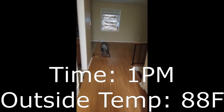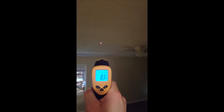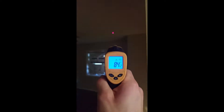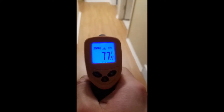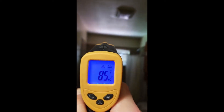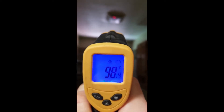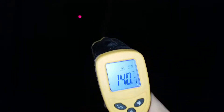This is a temperature recording of areas before applying the lime to the roof. The ceiling is at 83 degrees. The floor is 78, and right around the thermostat it's 77 — so the thermostat's reading correctly. It gets up to 86 to 87 near the vent. The vent is hot. Here's the attic area — the actual roof decking is 140 degrees.